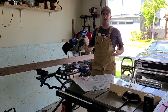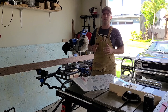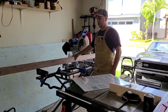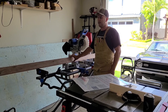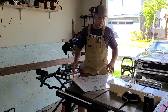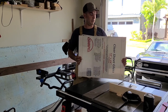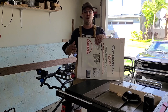For the shadow box build you're not going to need a ton of materials, but you want to make sure you're using a nice piece of hardwood or a combination of different hardwoods. For this shadow box I'm going to be using walnut — three and a half inches wide by three quarter inch thick, about a ten foot piece. I'm also going to build it around this 18 by 24 inch piece of pre-cut glass, so I don't have to mess around with cutting glass.